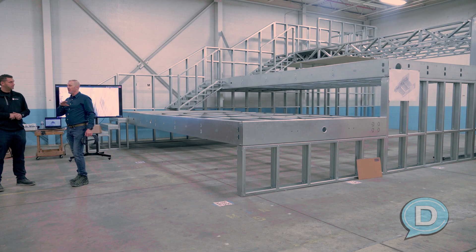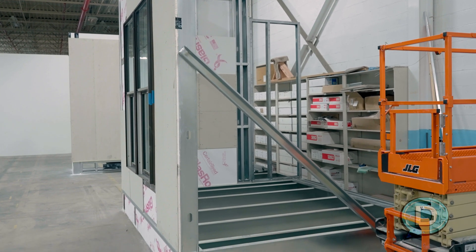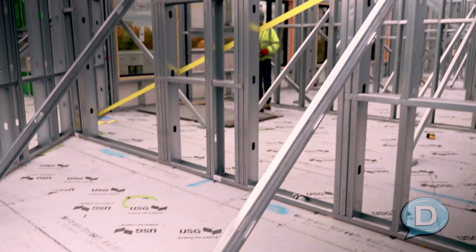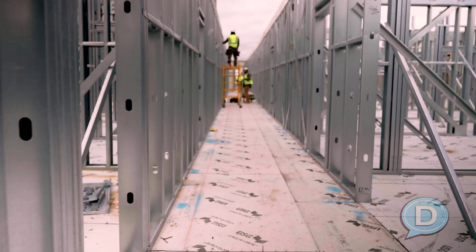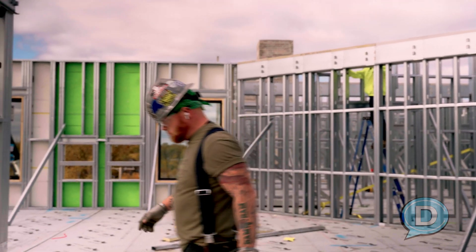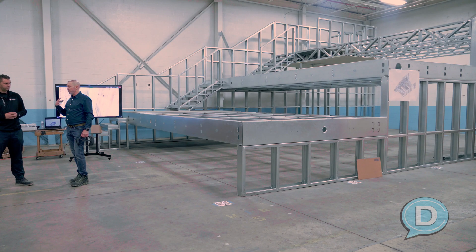This is just one of the structures that you build on site. You also have mock-ups where you build the walls and the windows, so when people come here they can actually take a look at that. Tell me what the value of the mock-ups are. We do those mock-ups for a number of reasons: to test fasteners, to give the client a full look at what he's getting at the end of the day. We can go over connection details, wall manipulations, hold-off spacing for wall joints, whether they're using cement board or how our SRT is going to react with trusses, how he wants the window framing to go, what kind of rough openings he needs. Anything that the developer or operator wants, we can go through, build it all, and let them put their hands on it and touch it. This augmented reality is a huge value — this is a small scale, but this can be done throughout an entire building.